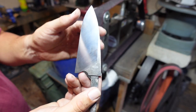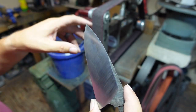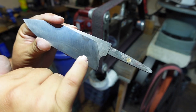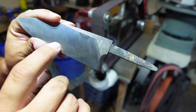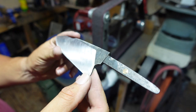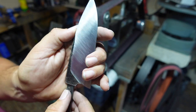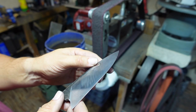We just got done hitting it with our scotch-brite belt — just a medium scotch-brite belt. We did our 120-grit belt first, but just with that and the scotch-brite belt, you can already see the hamon line popping up here. It doesn't stand out a ton when it's just sanded, but you can actually see the hamon line going across here, and it works all the way across to the tip. That hamon turned out absolutely awesome.